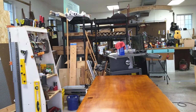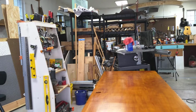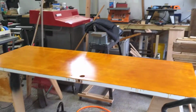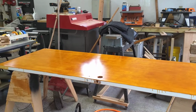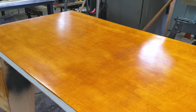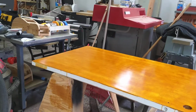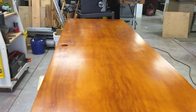Anyways, this is a quick Friday update, with it being the holiday. I'm not getting a lot of work done in here. We are, as you can see, working on a couple of doors for Mrs. Rattlecan. These have been stripped down and given 2 layers of shellac and so far 1 layer of lacquer. And then we might just paint them and be done with them because, you know, they actually look okay.